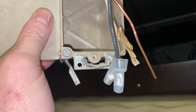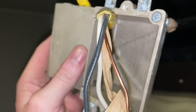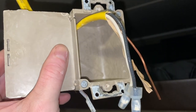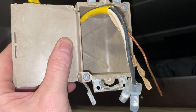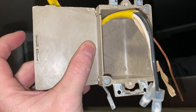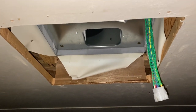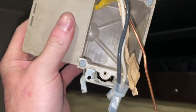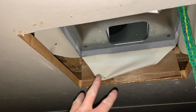Make sure the power is off. On my unit, this was actually my main AC breaker and it was hot — so you want to check this before you start messing with it. Mine was labeled wrong: my prep breaker is actually the main AC unit up front, and the main AC unit is actually labeled as the prepped AC unit. Just keep that in mind — this is a Forest River Puma. I've got the power off and verified it. Going to cut those off and reroute the wire up next to the duct for a wire penetration.